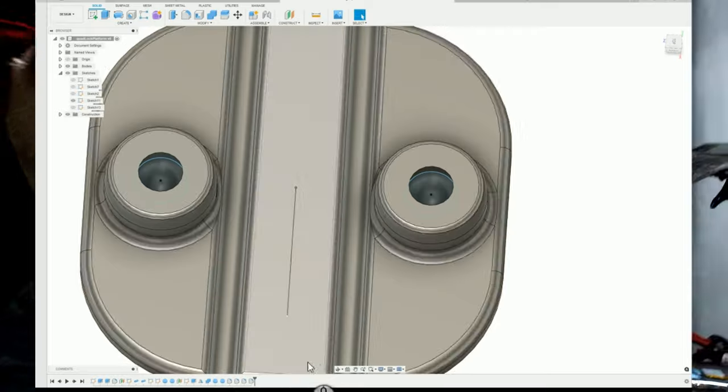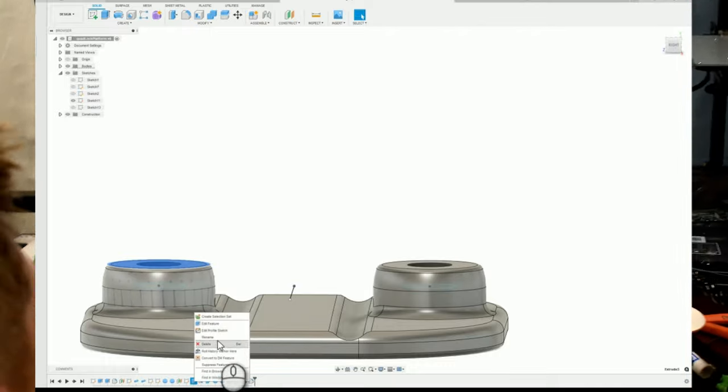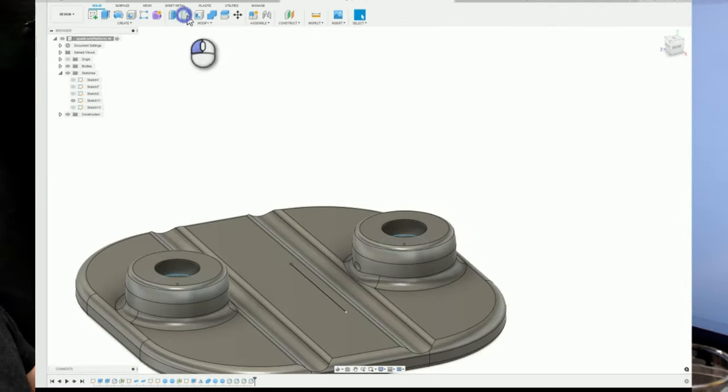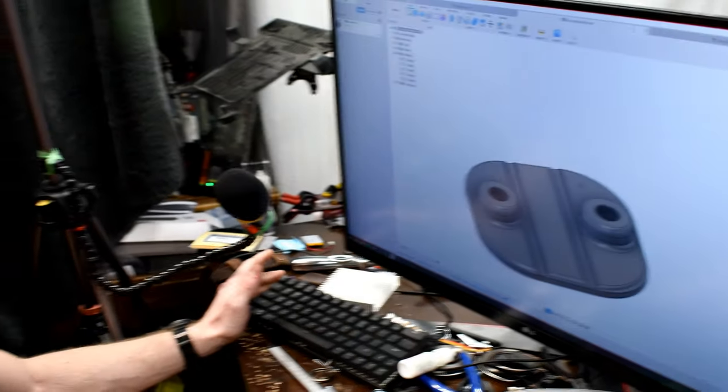Because that is pretty aggressive, I kind of just eyeballed and cut down a certain amount. This might need to be cut down a little more. I'm going to go 10 — go a little bit deeper. To be honest I'm kind of just guessing. I'm trying to reverse engineer this Lockline. I haven't really looked online if there's a specific diameter you can just copy, but the other aspect is people don't have my printer and they're not printing with PETG, so it's really just trial and error — denial and terror, whatever you want to call it.